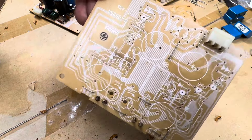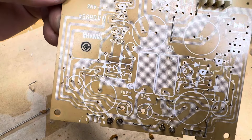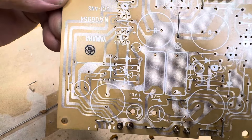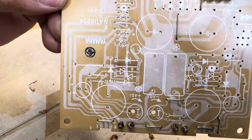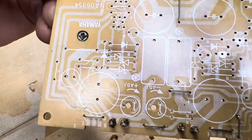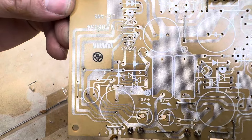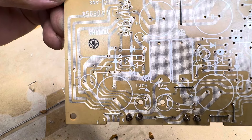I hope this was useful and saves you some time. I know other people use different ways of removing glue, but I've probably tried all the other techniques and nothing comes close to the effectiveness and speed of this method. The optimal outcome is using a heat gun and a blunt object — it does take a little bit of technique. I'd be lying if I said I never scratched the silkscreen. But there you have it — talk soon, bye.